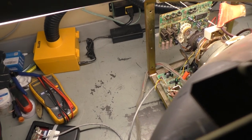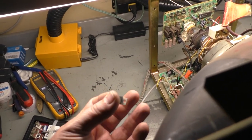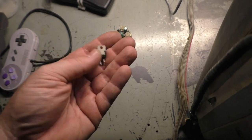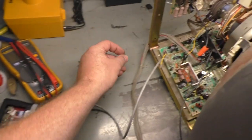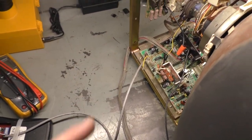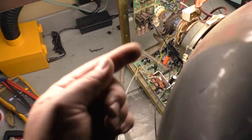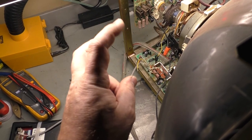And I'm like, well, okay, the transistor's not turning on. So I went ahead and just put a new one in, and if it still was not working, then I could trace other stuff out. But I put a new one in, and blue came right back. So this thing apparently died right here in front of us. So we can add that to our list, and it's still not discharging when you turn power off. It's supposed to discharge, but it's not auto-discharging.